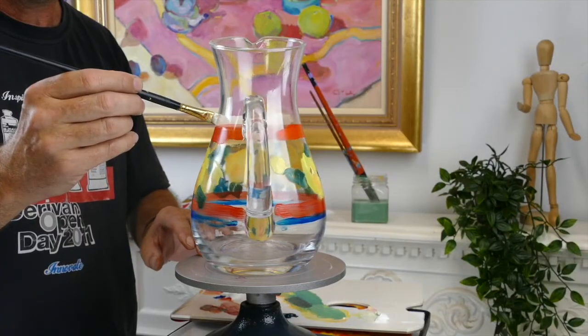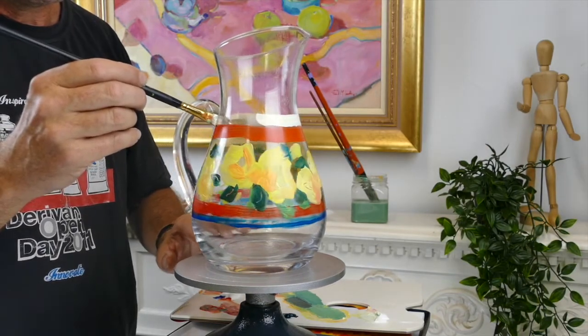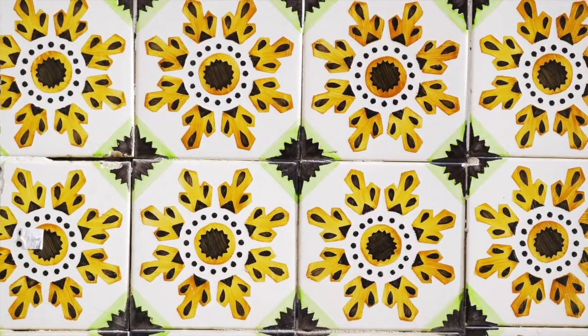What the clear sealer does is it goes down on a surface before you apply the paint and bonds to that surface and allows the paint to bond really well and stick to it. What sort of surfaces? Well, pretty well any surface. So non-porous surfaces such as glass or metal, ceramics, tiles, smooth concrete, any of those surfaces, terrific. They'll be fine, just need to prepare them beforehand.